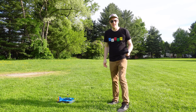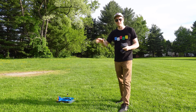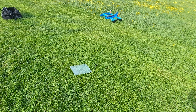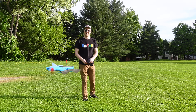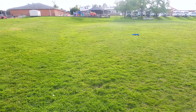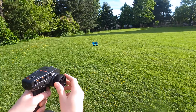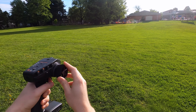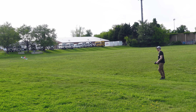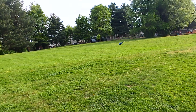Last thing in the radio I did was map this third auxiliary channel to take off and landing. So when I push it, it should take off to a fixed altitude and then I'm free to fly. I was honestly blown away by how fun this thing was to drive around. Normally when I'm flying a racing drone, it takes a whole lot of focus to do these sorts of coordinated maneuvers, but with the RC car radio and control input mixing, I was throwing it around like a pro on my first battery. It definitely drifts around a lot and takes some getting used to to keep it stationary — you kind of have to turn it so its back is facing the direction it's drifting and apply a bit of throttle. But when you get some forward speed, it basically turns into a drift car. An awesome flying drift car.